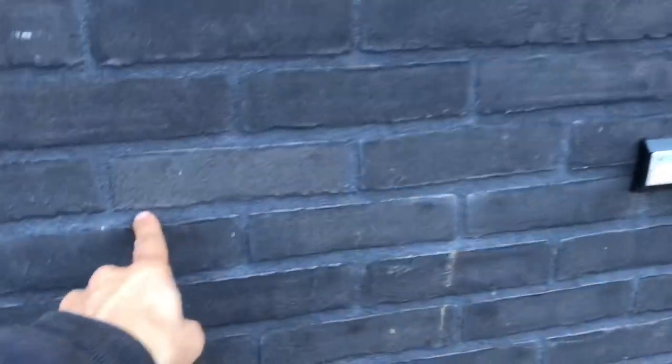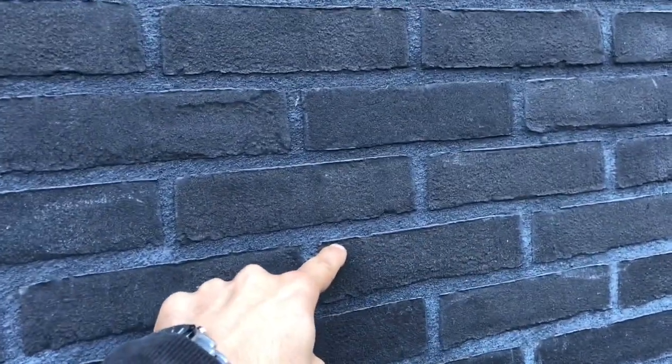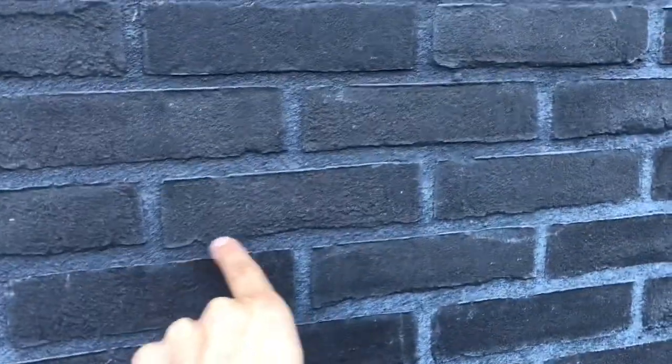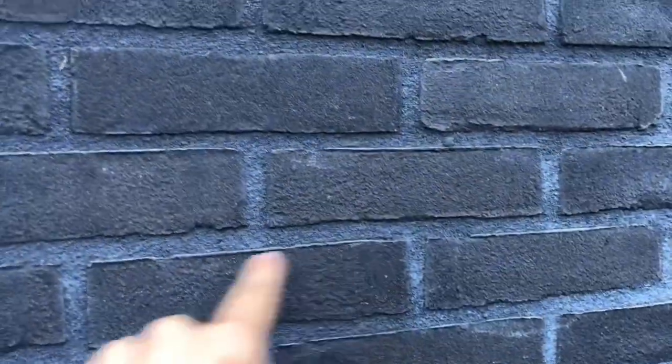If you let your brick smile, it looks better. Maybe his theory is that this line is sharp and straighter. But if the brick has this shape, the effect is quite different. I would have turned this around so the brick will smile — see? This one also, I would have turned it around, and these two points you put at the wire.